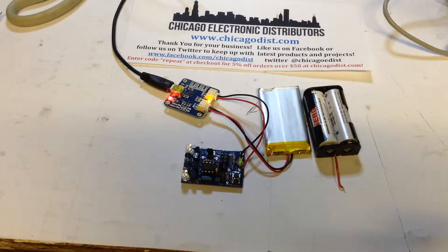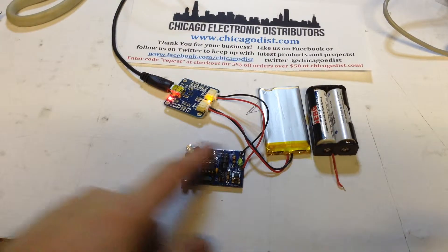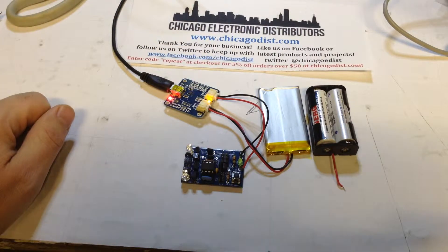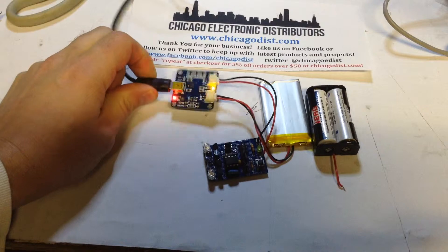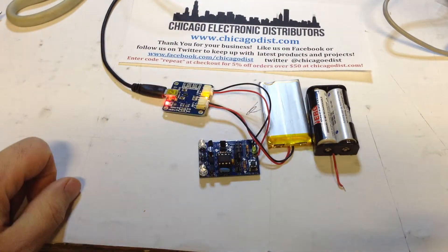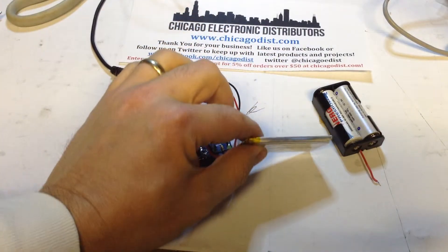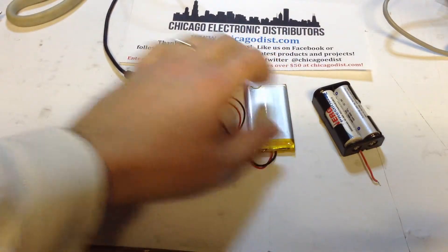We didn't put it together quite correctly but it works. We connected it up to a lithium-ion battery — we used to power it from two double A's. This little charger circuit automatically charges the battery until it's ready to go. All you really have to do to put it together is solder a couple of things on — it was almost nothing. We disconnected the original battery pack and wired this one in, and that's all we had to do to get a really nice slim rechargeable battery. Hopefully it's all wired correctly — we don't want it to catch on fire like those Teslas.